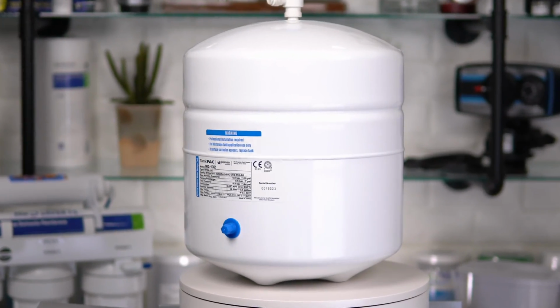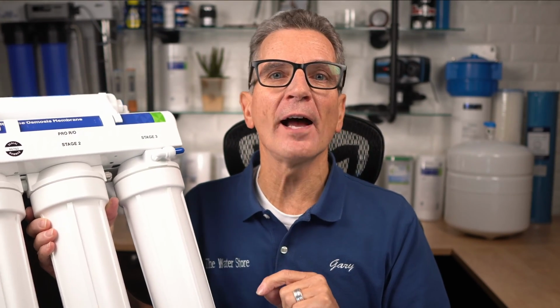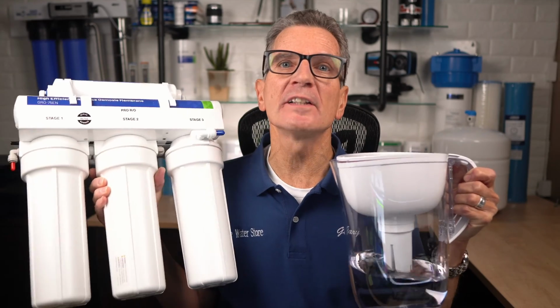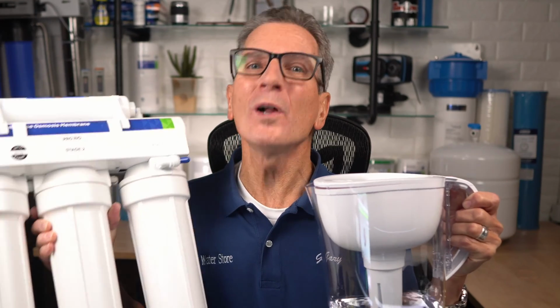This $500 5-stage Hume high-efficiency reverse osmosis drinking water system gets installed in your home, so you have limitless amounts of reverse osmosis water on hand. Now, this system uses your household water pressure to force your water through a sediment filter to remove the dirt, 2 carbon filters to remove the chemicals. Then water is forced through the membrane under pressure, and that treated, purified water is stored in a tank. When you open the faucet, water flows under pressure from the tank through the dedicated faucet quickly to fill your coffee carafe or make your Kool-Aid. I sure couldn't believe the difference in the lab results that I found when we had the treated water tested, but we'll get to that later.